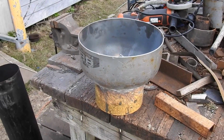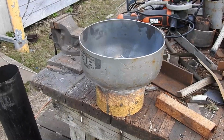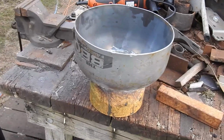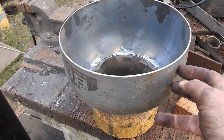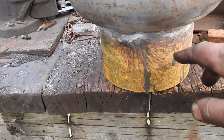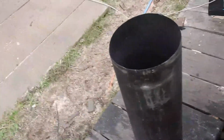Alrighty, my fellow wood gassers, you're looking at what I'm hoping is going to become a fuel funnel for the top of my newly developed torrefaction system. You saw me messing around with the torrefaction inlet and seeing how difficult it was to get the fuel to go in there. This piece here occupies 95% of the space available in the opening once the lid of the hopper is lifted. And of course we have a natural funnel shape here going down to some steel pipe whose outer diameter conveniently encompasses the stainless steel pipe that I'm using as the new fuel hopper.